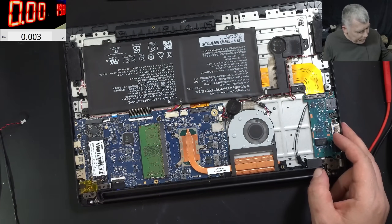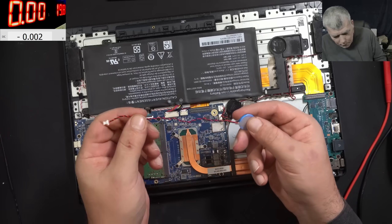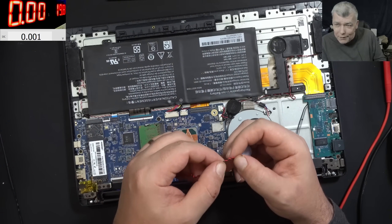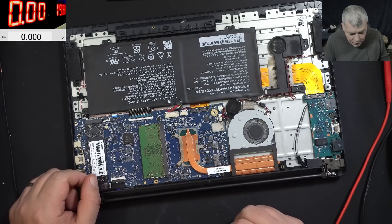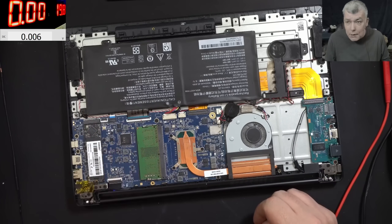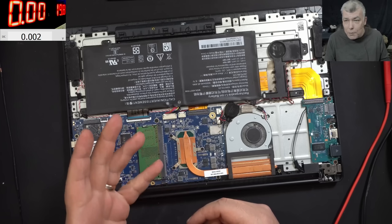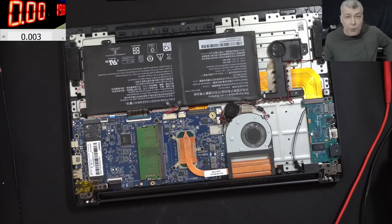So what do you think about that? Is it a perfect repair or not? Check here — a proper long cable, and this is a flexible cable. The lesson to learn: if you have this laptop, it has only one fault — that MOSFET. That's all you have to check or replace. Even if that MOSFET is shorted, the laptop does come on, but it's not charging or it's charging to a certain percentage. Have a beautiful week — it's Monday, see you on the next one. Bye.